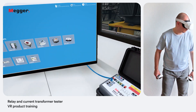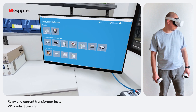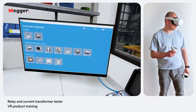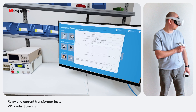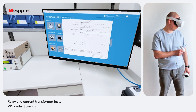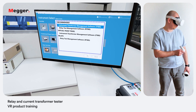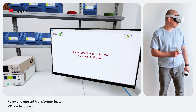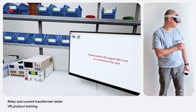After the PowerDB software has been launched, we are presented with the instrument selection screen. Go on and select MRCT on the screen. Make sure 'use ethernet' is selected and hit the OK button. On the next pop-up window make sure that instrument transformer management software is selected and click OK. Select the upper left corner device connection icon to initialize the connection of a PC to the MRCT.